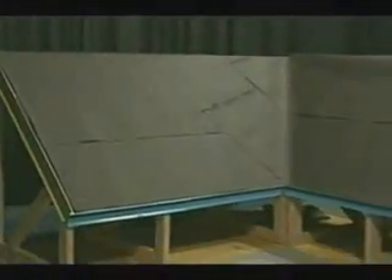The felt is fastened using staples or roofing nails. Cap nails should never be used because there is a chance that the thickness of the nail could telegraph through the panel. This could harm the integrity of the panel.